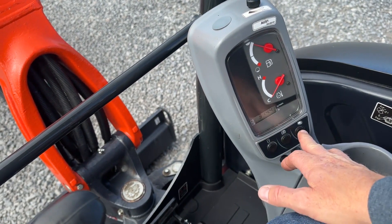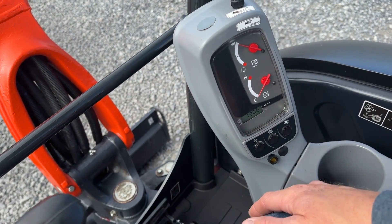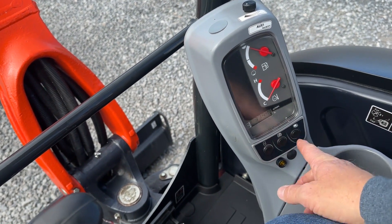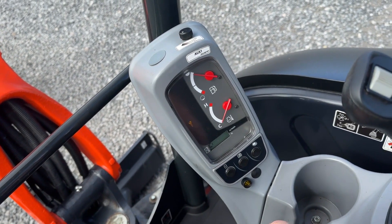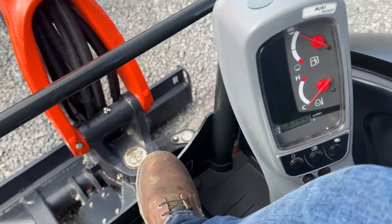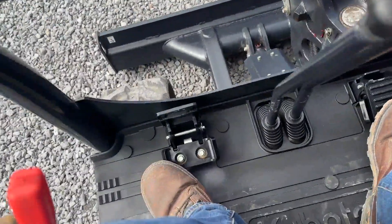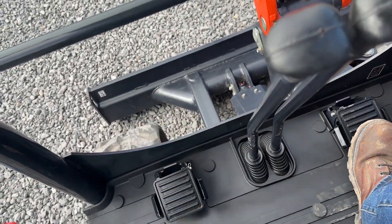The timer shows 215 hours on that screen, and I believe this takes us back. That's going to be 1,306 RPM. C is going to be for your error codes — you can see there are no error codes. Over here is going to be your swing boom. For your boom out here, that locks out. And this is going to be basically a foot rest, or if you had an extra third function to hold the machine.